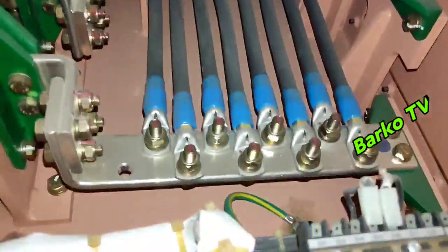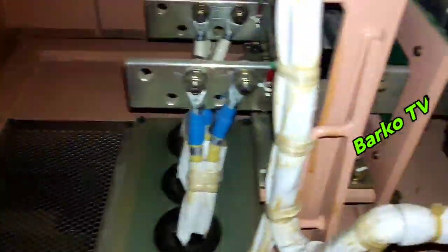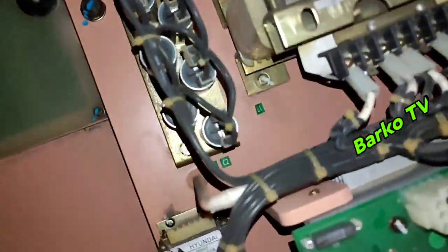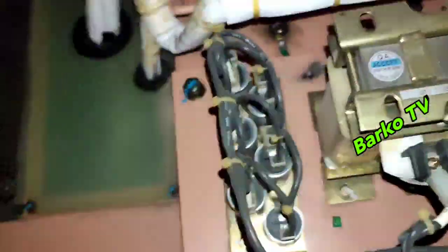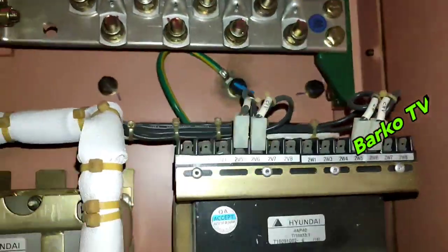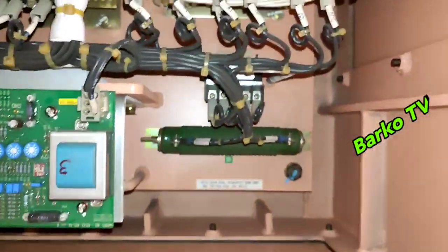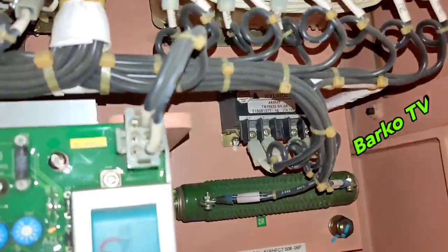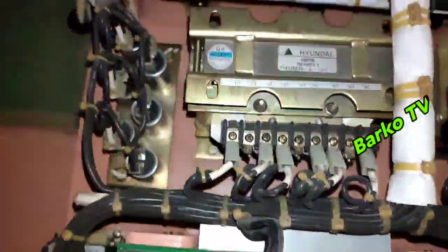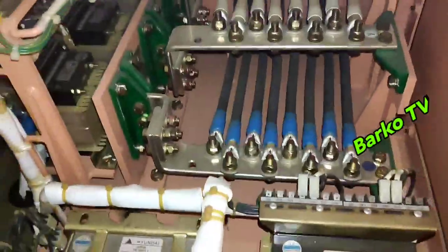This is the internal view at the top of the alternator — these are the components. These are the terminals of the main winding at the top. Need to familiarize: those are current transformers, capacitors, reactors, and the terminals. On the other side is the AVR. We need to familiarize the AVR and disconnect the three connectors X1, X2, X3 for safety.